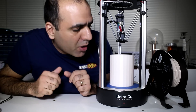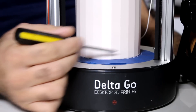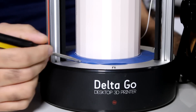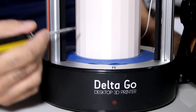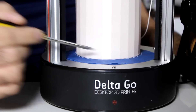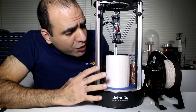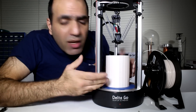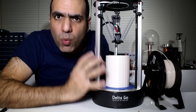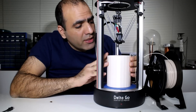I kind of messed up a little bit. The pad didn't stick to the bed well and resulted in some warpage. Although they said I should clean the surfaces with isopropyl alcohol to make sure things stick together well, I didn't because I didn't have any. The material cools at different rates and this can cause warpage if surfaces are not holding to each other well. This is the kind of attention you need when you don't have a heated bed and you want to print large surfaces. A heated bed makes sure the material sticks to the bed well and keeps the temperature even on the bottom, so it's much less likely to warp.